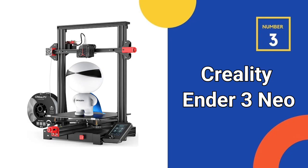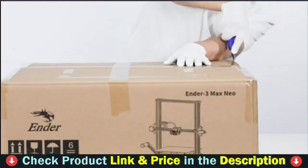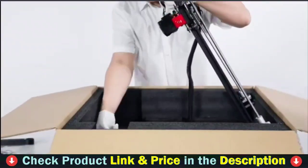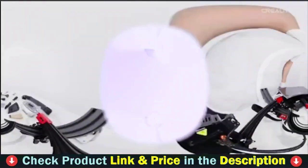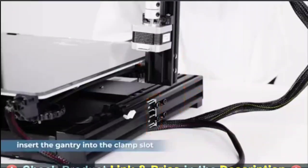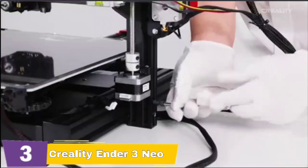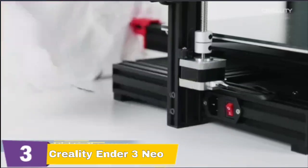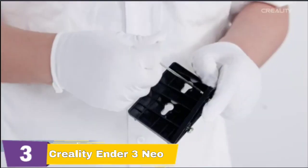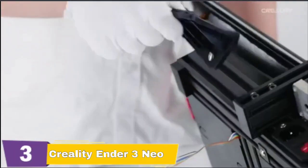Third pick in this best 3D printer under $500 video is the Creality Ender 3 Max Neo 3D printer. It is equipped with a CR Touch sensor, which improves efficiency by automatically measuring and adjusting 25-point print height on the heat bed, making leveling much easier. The build volume of 300 x 300 x 320 mm allows printing of both large models and small parts, or several small models on a large build surface simultaneously, greatly increasing efficiency. Perfect coordination among dual Z axes, timing belt, and dual motors guarantees stability and higher printing precision, effectively avoiding printing deviation and reducing the possibility of lines and bulges. The Full Metal Bowden extruder is more durable with greater extrusion force, guaranteeing smooth in-feed and out-feed while reducing the risk of nozzle blockage.